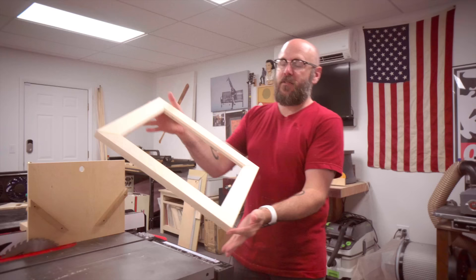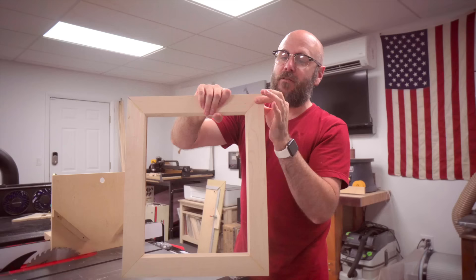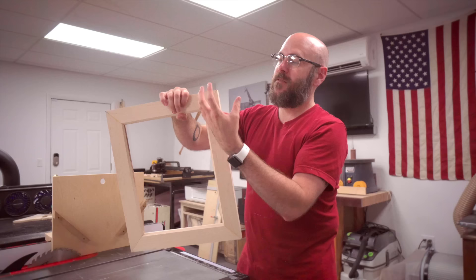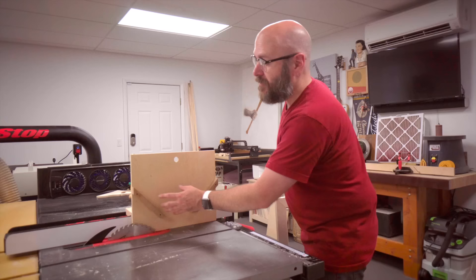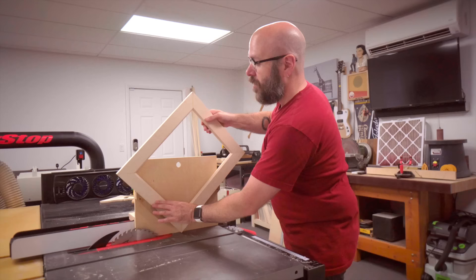Our frames are all dry and I've taken the tape off. These joints are not very strong — they're just held together by glue and that's basically just end grain. It doesn't make for a very strong joint; as the seasons go by the wood's going to expand and contract, and that's going to loosen and break eventually. So we need to reinforce them. I've got the spline jig over here on my table saw — I'll have a link in the description. For this first picture frame we're going to do splines, and then the next one I'm going to show you a different method that doesn't involve a jig.